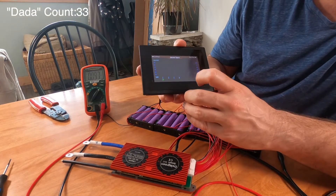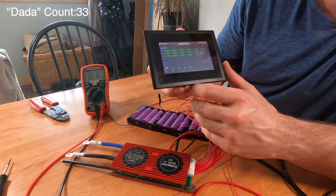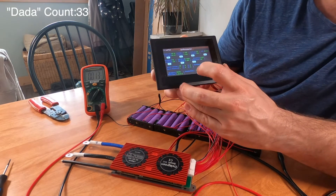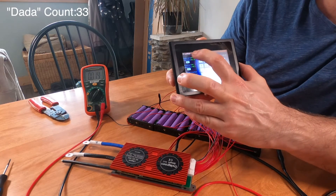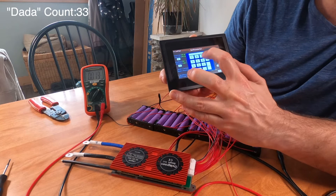You can go to the next page and see each individual cell voltage, and you can go to the settings page. It's a little tricky but if you click on the green values they are adjustable. There's the high current — we'll go 130 for this for now.